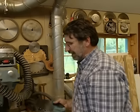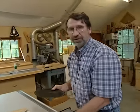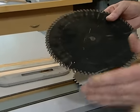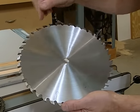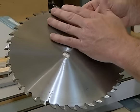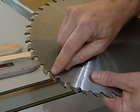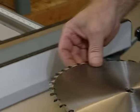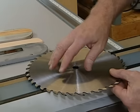Let's talk about saw blades. I can only make accurate cuts if I have an accurately set up table saw and a good sharp blade. If all I were going to do were crosscuts, I would choose an 80-tooth crosscut blade. But since I'm going to be ripping as well, I want a combination blade — this is a 40-tooth blade, ground in such a way that it can rip as well as crosscut. A blade is made up of a piece of steel, fairly thick and flat, cut out with carbide tips welded to the ends and then ground to the right angle. These carbide tips are very fragile, so I don't want metal to metal — they could break off and chip, and sometimes they chip just from use, but that doesn't mean I throw the blade away.